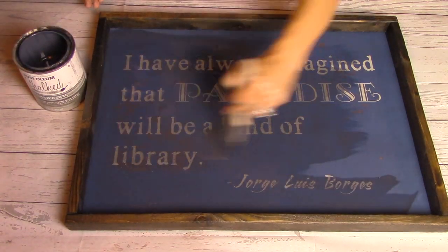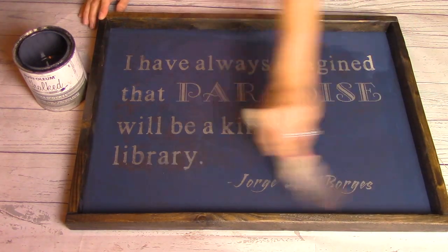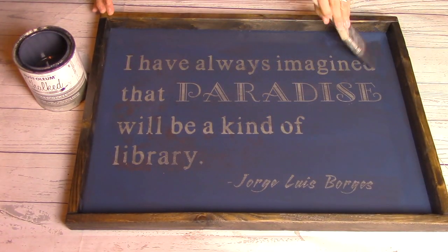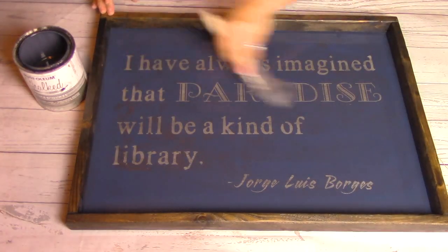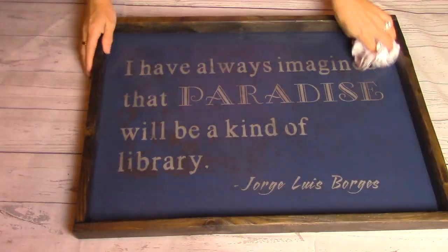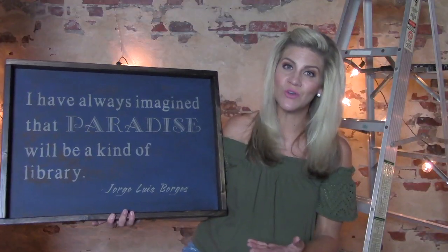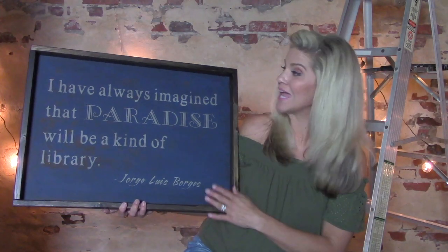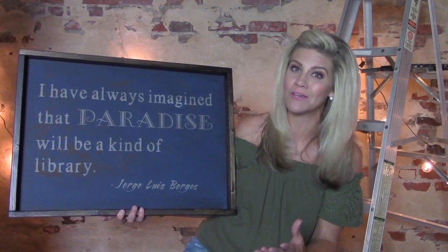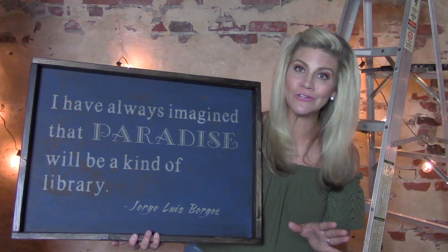My magic ingredient to fix this is another coat of the Rust-Oleum smoked glaze. If you watched part one, we used this on the blank sign when it was just blue paint. I'm going to go back over the whole thing, lettering it all. Stir it up first, then using a synthetic brush paint a layer over the entire sign. The whole point of this glaze is to give an aged antique look, so I'm hoping this makes it look less like a huge blunder and more like a piece of artwork that's been sitting in someone's attic for the last 60 years. After giving the glaze a couple of minutes to soak in, I take a rag and wipe off any excess.